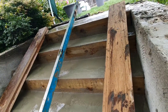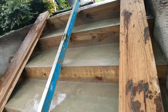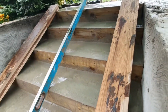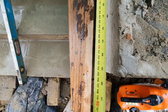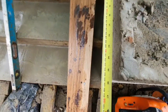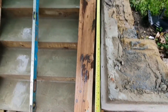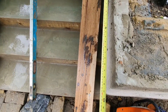We've been forming these concrete steps ready for porcelain, and you can see the levels touching every single step — they all have equal rises and equal reach. I'm going to show you how to set up by doing the calculations. I knew it needed to be 1140mm from that top step to the end of the wall before the top goes on, so I've provided that by four steps to get up to that top step, which gives you 285mm.